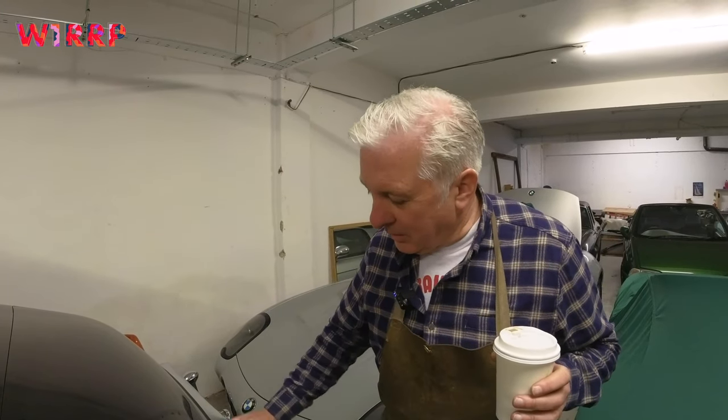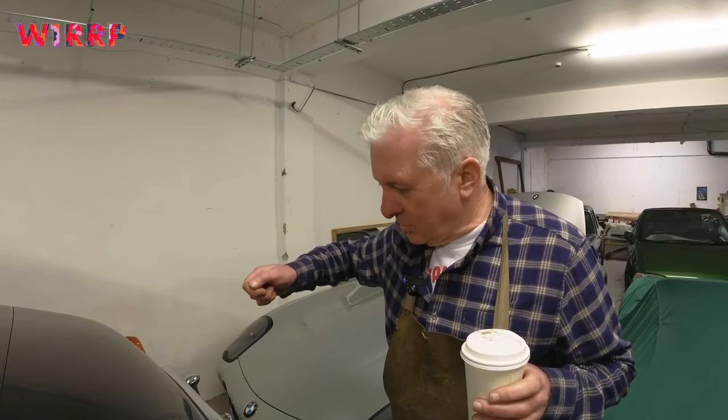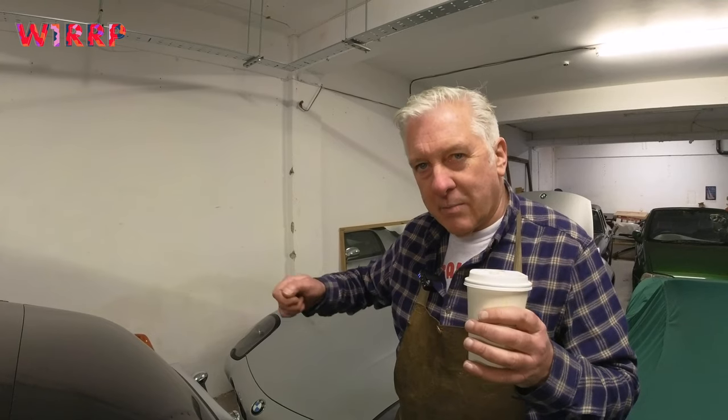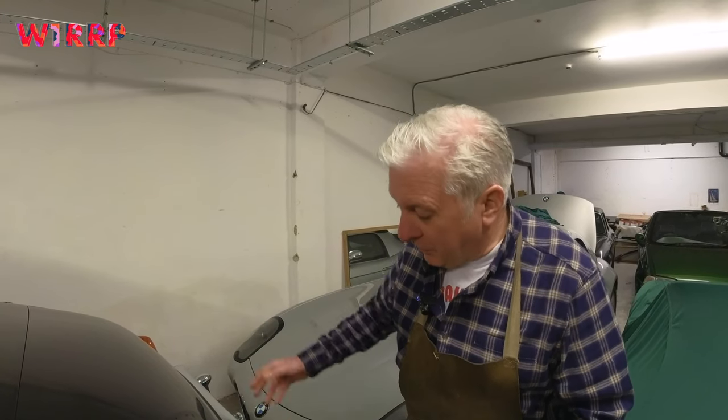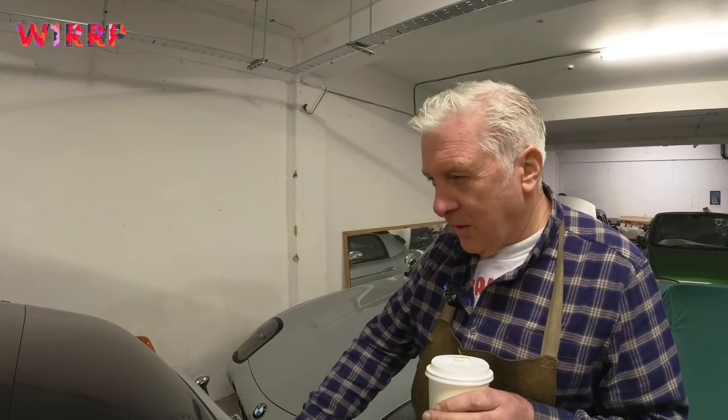It was a series of tacks, then you cleaned it, then you wheeled it through once just to get it in line. Dickie Foot was a fabulous welder - you could go along there without hardly any filler material and create a beautiful weld with penetration. The apprentice would wash off the flux with boiling water when finished. It was then filed up, because it had a file across it to get the shape.